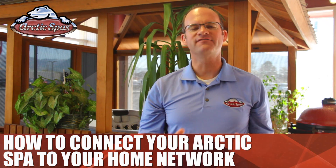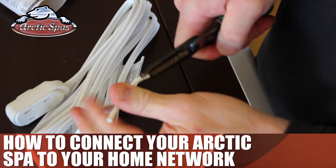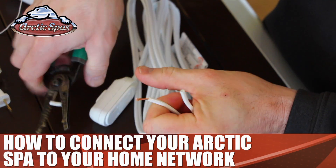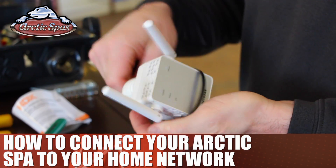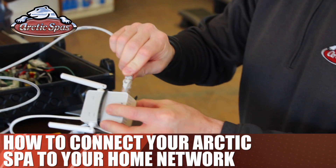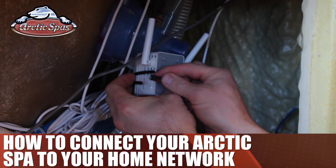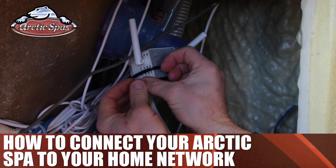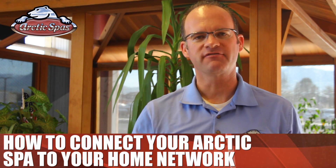Second, we'll need to get the Wi-Fi extender set up. You'll need to take the electrical cord, cut the male end off, separate the wires, strip back the insulation, and crimp the connectors. Then plug the extender into the extension cord and zip tie them together. Next, plug the ethernet cable into the Wi-Fi extender. Mount the extender on the side of the spa that is closest to the Wi-Fi router for the best signal. Run the cords back to the motherboard, then turn off the power to the spa.